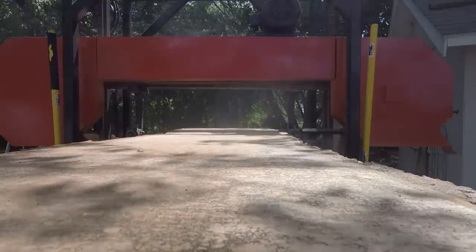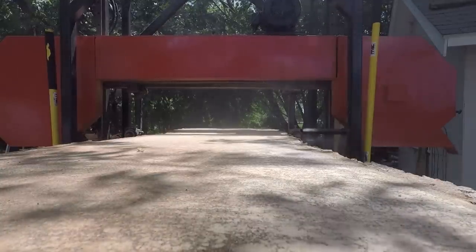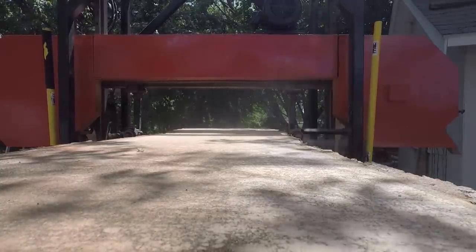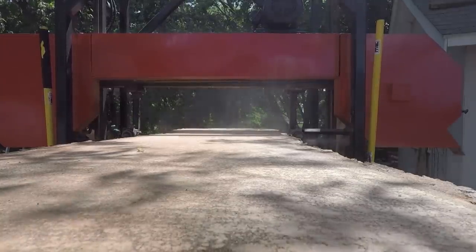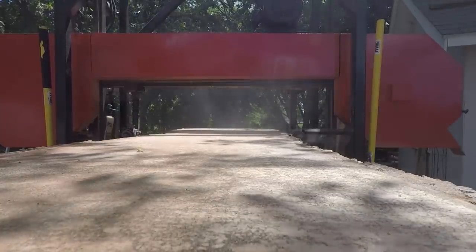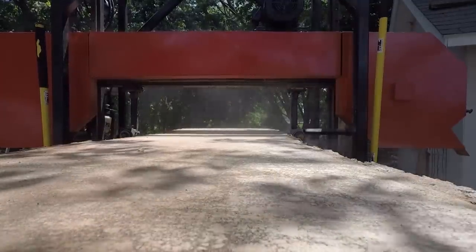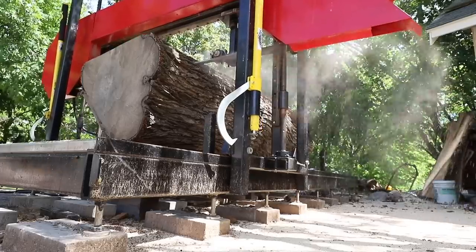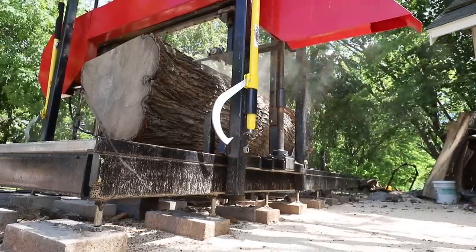Now, the reason I don't want to pull the steel out is because that damages the wood around it quite a lot. Even if you're able to pull something straight out, you're still likely to get a good amount of damage around those fibers. So I prefer to leave them in there so that if these were turned into a tabletop, for instance, in the future, that steel could be left embedded and be part of the story of the tree and the slab itself.